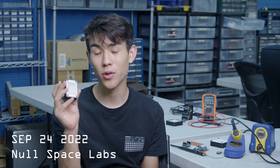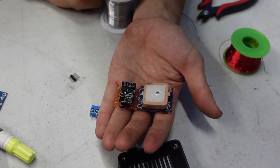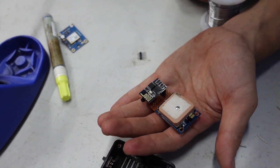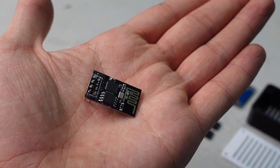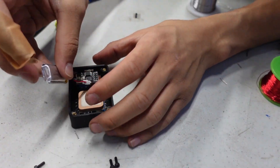I made this 3D printed GPS tracker prototype, and while it's not the most covert or discreet form factor, it does look kind of cool. The wifi tracking mechanism is actually kind of novel. Inside this device we have a GPS module, a $2 wifi microcontroller called the ESP8266, a battery, and a vibration sensor.